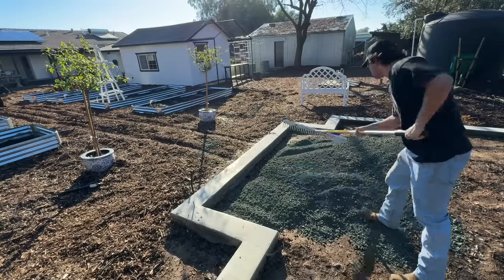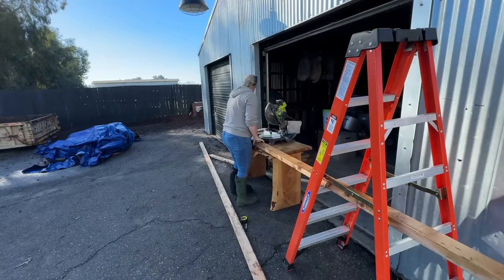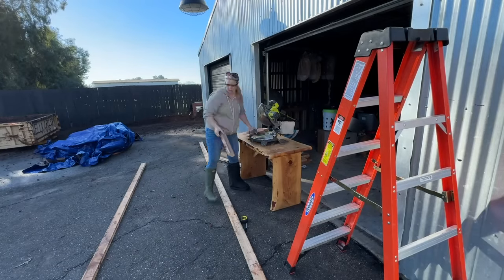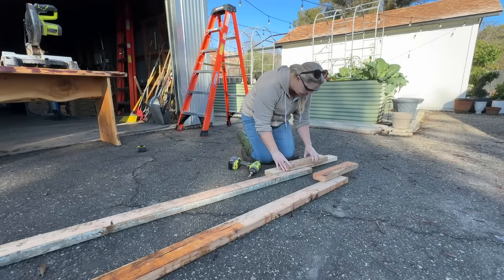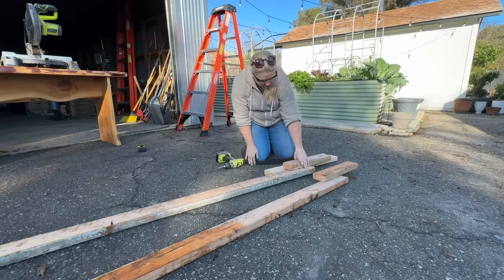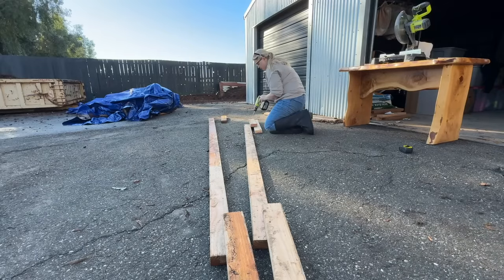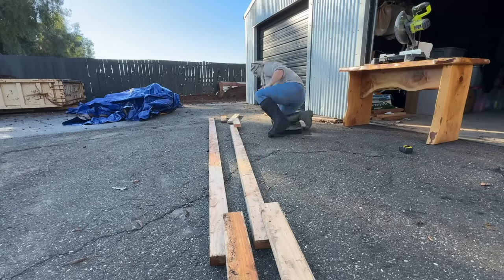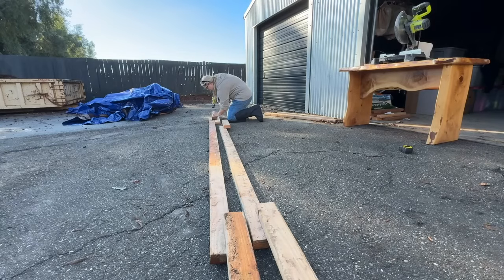I have a pretty even ground in my back garden, but if your ground was more uneven, you could level out the high parts and add more aggregate base to the low parts. While the guys worked on getting the base into the greenhouse with the skid steer, I started building what I call a leveler — also called a screeder in concrete terms. The pavers going on top were about two inches tall, so we needed to bring the aggregate base up to two inches below the top of the concrete perimeter. I used leftover two-by-fours, cut them about 12 inches shorter than the width of the greenhouse perimeter, and put handles on the ends set two inches above the leveling piece.